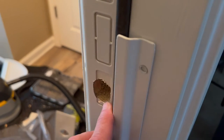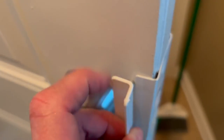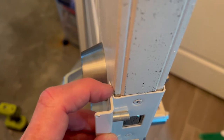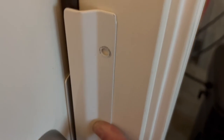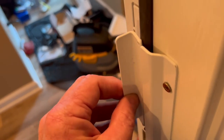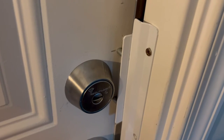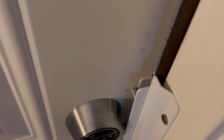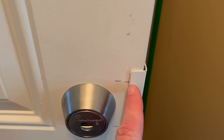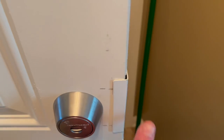When positioning the plate, you have to determine how close it's going to be to the door. This piece is going to screw into the door, but it's also going to be sitting on top of this. Even though it's going to be over here, it's going to be sticking out that much — so you have to allow for all that distance. Close the door, and from the edge of the plate to the door you want at least a quarter inch. I put two short screws in there and use that to do all my testing. I need to get this positioned on the door so it goes right between there — it's got to have a little bit of room on each side. I put it in place, push it against the door, and pull the door toward me to get that thing aligned. Once I know where it is, I draw those lines so I know where to drill those holes. I have to drill my holes right on the edge of the plate, which is going to be a challenge. Use a bit that's a little bigger than the screws because the plate will hide the holes — they don't have to be perfect.